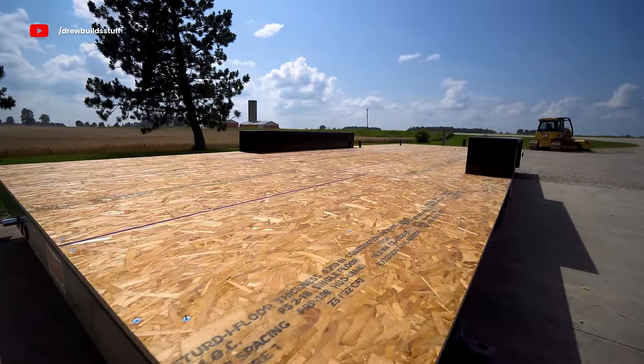If I couldn't nail the header into place through the stud, I would just toenail it like this. I only put 2 in here, but I would usually put in 3 or 4, and I did that all later, I guess. I also nailed the 2 header boards together using about 4 vertical nails every foot or so down the header, and I don't have a clip of that, unfortunately.